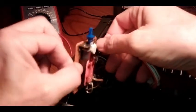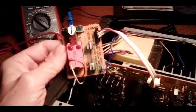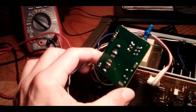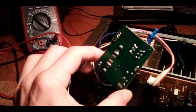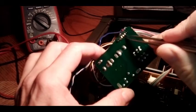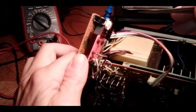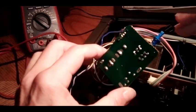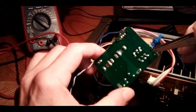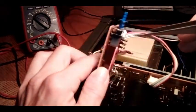The good thing is it comes out pretty easy. Interestingly, I remember this from the A5 power switch — the speaker switch is actually utilized on the A7 here, where it wasn't on the A5. I think they used a muting circuit or something on the A5, but don't quote me on that. So the speaker switch is actually active, which I don't know — to me that's kind of a bad thing, because if there are problems with the speaker switch, we're going to have issues.